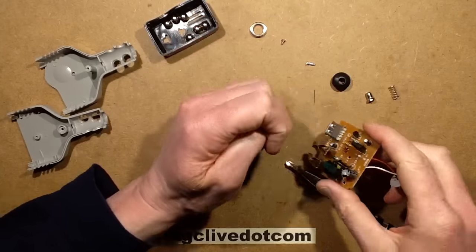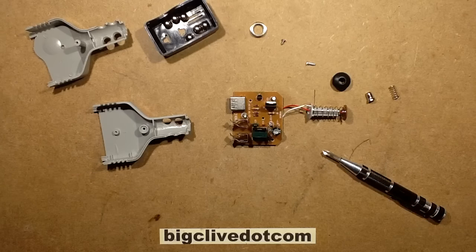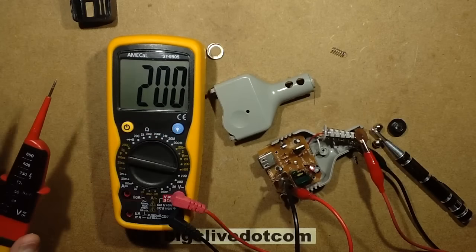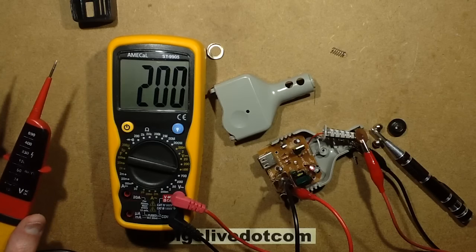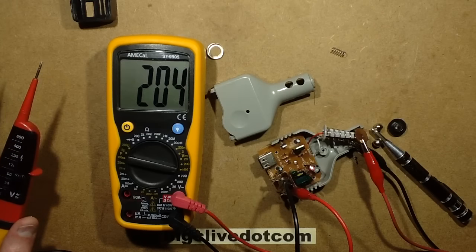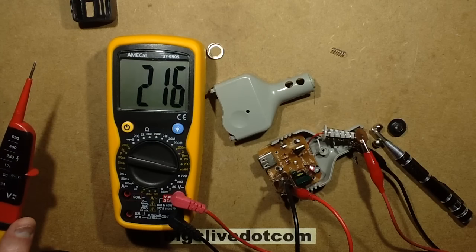It's a very, very odd little circuit but quite interesting nonetheless — really limited, very strange. It says it's apparently rated to 24V, so I think we should give that the full test. Here it is running at 13.8V, putting out 200V. Let's crank it up. I think that LED and resistor is also acting as a sort of shunt — the higher the voltage goes, the more current it passes. So now we're up to 18, 20, 21, 22, 23, 24 — let's whack it right up to the top.